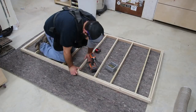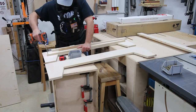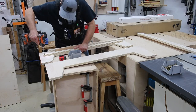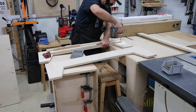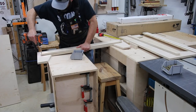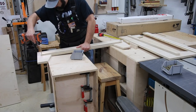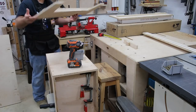Getting back to the project, I'm creating what I'm calling the lower support assembly, and that's just going together with butt joints and pocket holes — no big deal. I'm adding in a support strip according to plan to each section of the bed frame, so when the bed frame goes together it creates a nice support ledge all the way around the inside of the bed frame. That's going to give the lower support assembly something to attach to, and on top of all of that will be a support panel that the mattress will rest on.